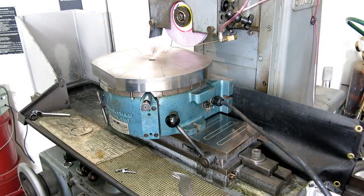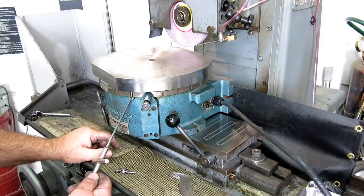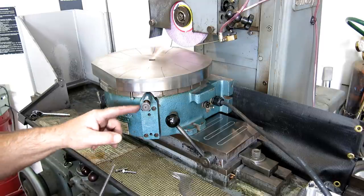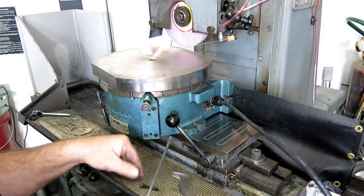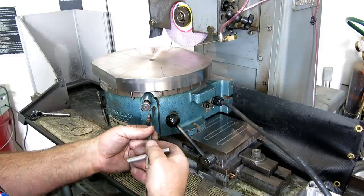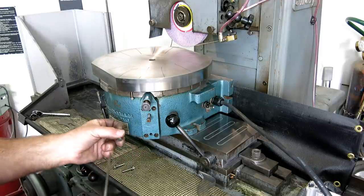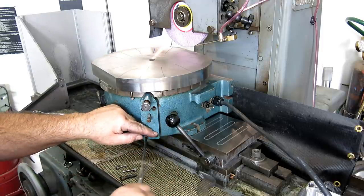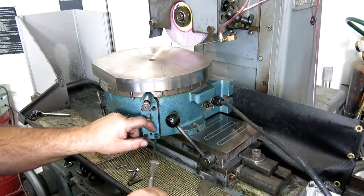Close. All right, I hoisted the rotor grind up here. This thing weighs a ton. Now, you can see here, this is a fastener going into a tapped hole in the bottom of this, right? But it doesn't clear this detent stop, so we gotta take this little monkey off here. And actually, it's got dowel pins in it, and the guys that designed this actually put a tapped hole here, which is kind of nice to help push it off the dowel pins. That's just a nice pro touch there, right?